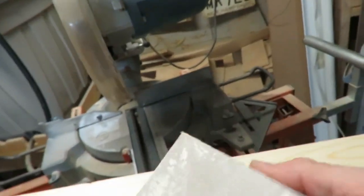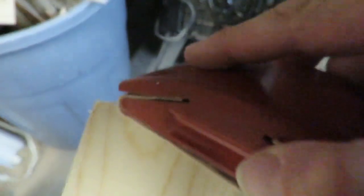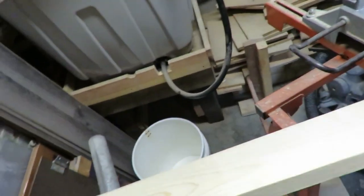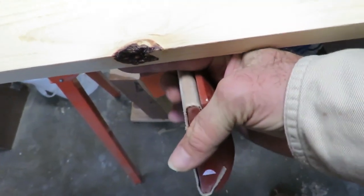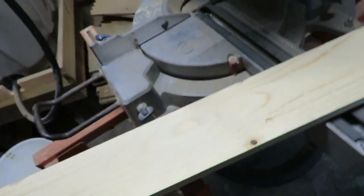I'll measure from here down and cut these at six feet because I need two of these at six feet for my verticals. After each cut, run a little sandpaper — just get rid of that rough edge from cutting, do it on all four sides, and also on the corners since sometimes you'll have little pieces of wood that fray. Just kind of get rid of the rough stuff; it's not like you have to sand for 20 minutes. This piece has been cut to six foot. It has some markings so this side will go against the wall. Also, there's a knot here — I don't want that on the portion where these two pieces join at a right angle, so I'll orient it to the other side.